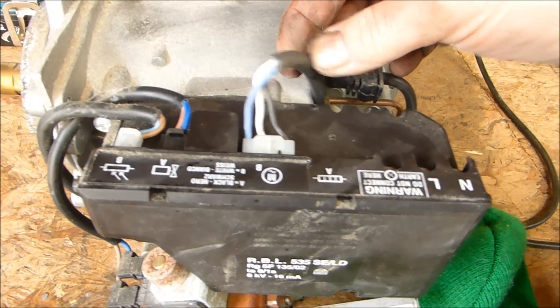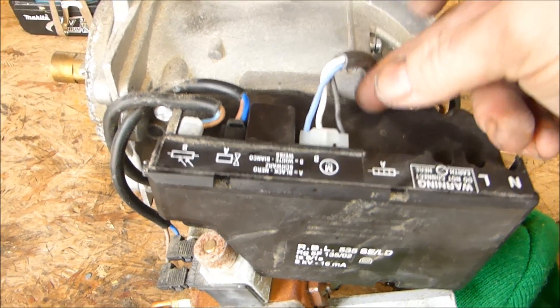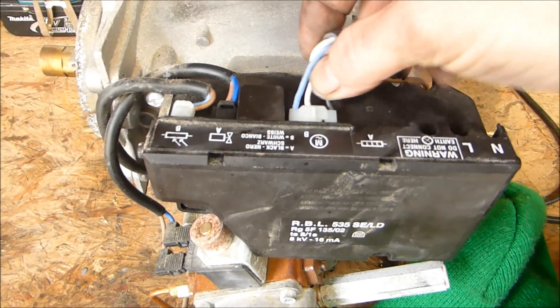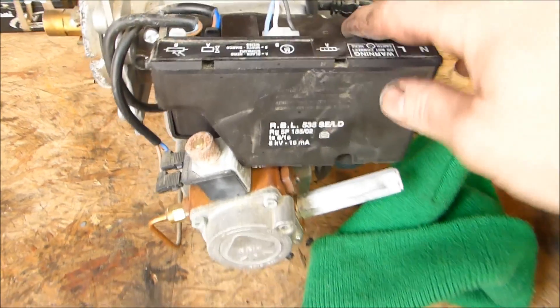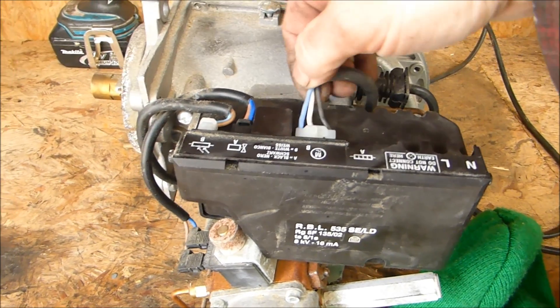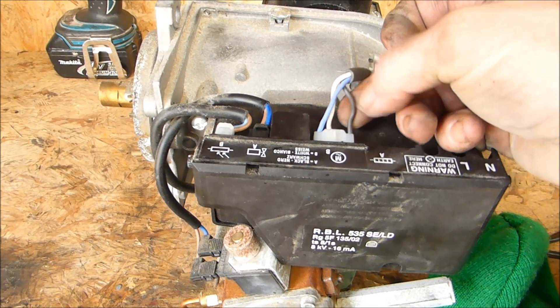This particular cable goes down into the motor and we've got a white wire, a black and a blue. We're just going to use the black and the blue. The white one, as far as I know, is a 50-volt back off the coil in the motor to feed the high voltage electronics and the solenoid. So we're not using it — it's actually an output from the motor. We just input on the black and the blue.